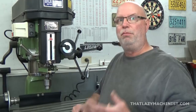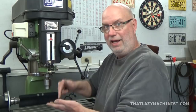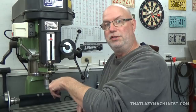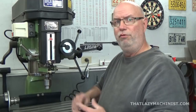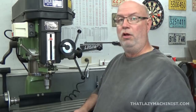Another problem with these machines is backlash in the quill. When using a knee mill like a Bridgeport, we feed the table up into the tool for milling operations, feeding against the tool that's bearing down on the part — so there are no backlash issues with that vertical movement. On this machine that is not the case. We're using the quill to feed in Z, which is the same direction we're forcing against the part, so I do have backlash issues. When I've taken one cut and want to readjust my depth and unlock the spindle, the quill moves and I lose all my references on the graduated collar — and that gets on my nerves.